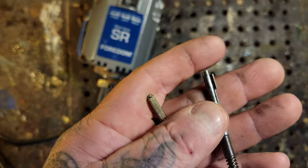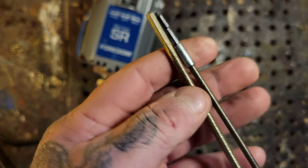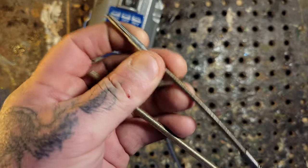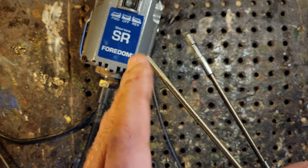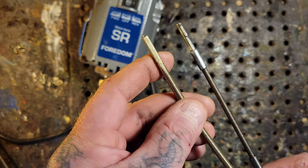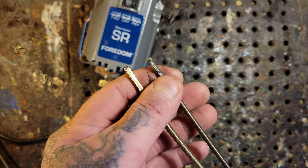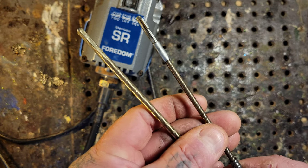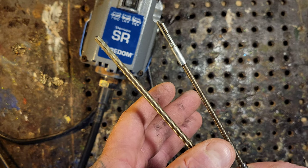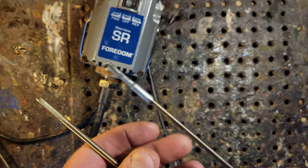The one on the right is key drive, the one on the left is square drive. See the size difference — the industrial square drive is more firm and solid; the key drive is more flimsy, more like a Dremel flex shaft. If you break lots of inner flex shafts, pay the extra money and go to the square drive. Since switching to square drive I've broken one flex shaft; with the key drive, which is much thinner, I've broken about 50. I'm not lying — I'm just a freak when it comes to carving speed.